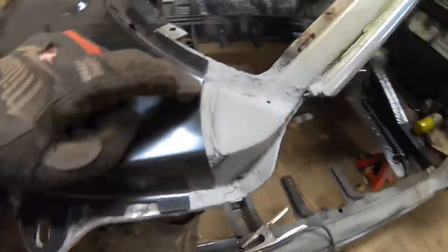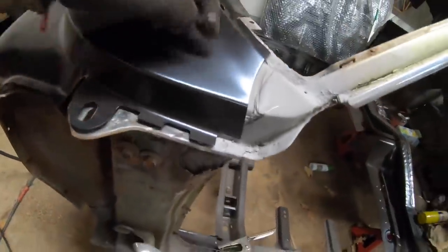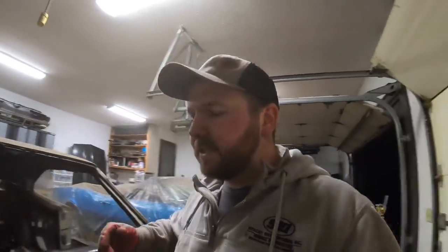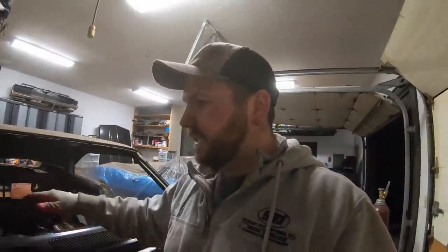So I did trim back this lead seam a little bit further on this side before I got started. But yeah, it's the importance of making sure you fit check every panel on this car, or any car that you're working on, just to make sure it all fits right before you make it permanent and you start welding. So we're gonna keep filling those holes in the underside here on our lower cowl section,